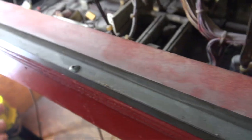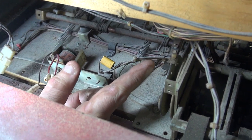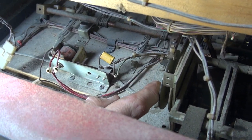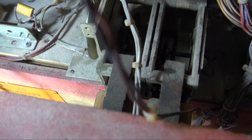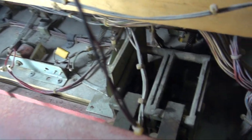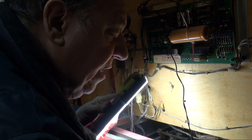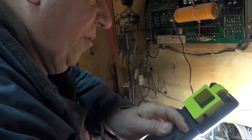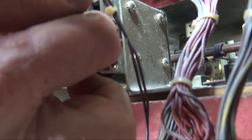So, you're going to first determine two things. When you start this, and you let go of it, it should stop instantly. It should not drift. If it's drifting, it means that the brake may not have kicked in. Okay? So then you're going to squirt some on those two points. Point one side, two, and the other side. So you have that movement.